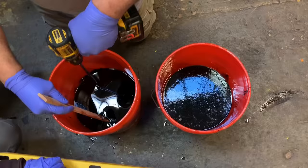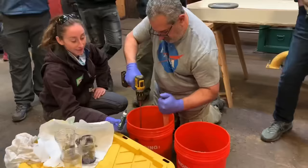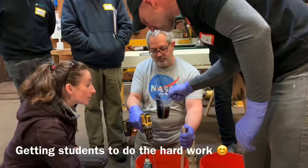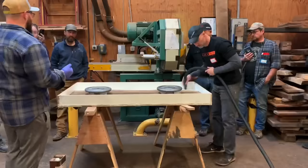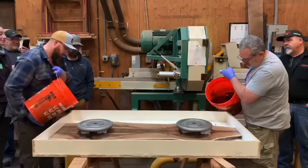This is a good time to mention that you do need to plan a little bit ahead if you want to try this epoxy table trick to double your thickness. What we're going to be doing is cutting a thin strip off the edge, flipping it over, and gluing it on the underside — which is going to cut any transparency you have in your epoxy in half. So if you're going to do a transparent blue, it probably wouldn't work very well. I'm using a jet black resin, so it's going to work perfectly. You need to choose a good solid color with no transparency to do this trick.